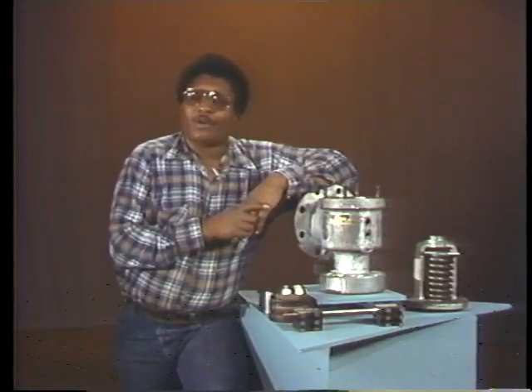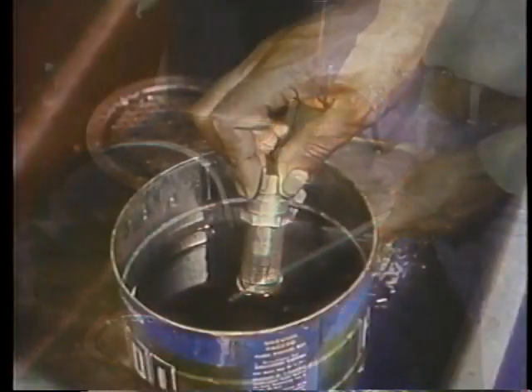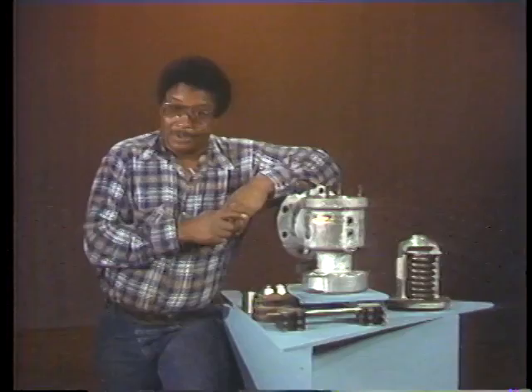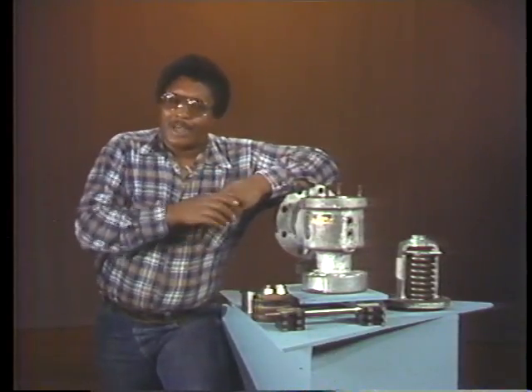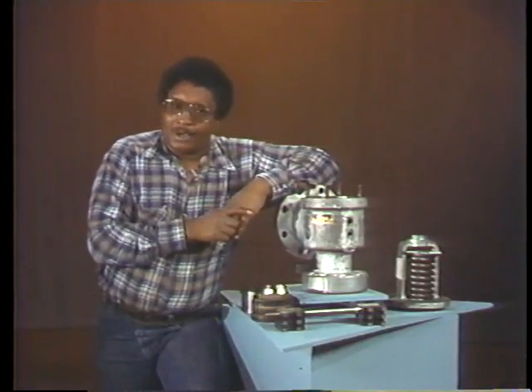The spring and the washers are a matched set. When you're doing safety valve maintenance, the step after disassembly will be cleaning all the parts thoroughly. This can be done at a cleaning station using solvent and a brush, or by dipping each part directly into solvent. In either case, be certain to use a solvent recommended by the manufacturer and get all the parts as clean as possible. Clean parts are easier to inspect and they fit together better when you reassemble them.